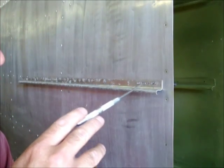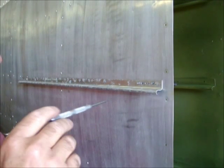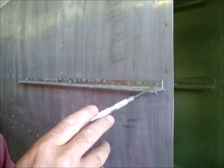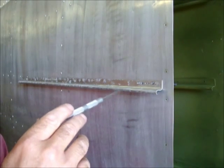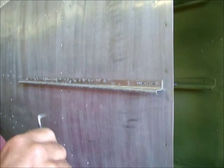The quickest way to find these holes for your nut plates on your stringers is to just use the existing stringer after taking the plates off and locate it. Make sure you've got it exactly over the top of your stringer on the bottom side, then you can drill your holes and install your nut plates.